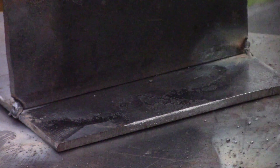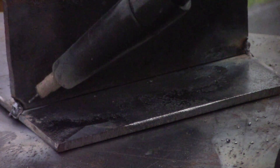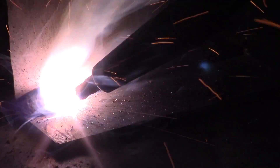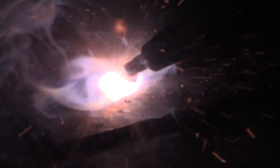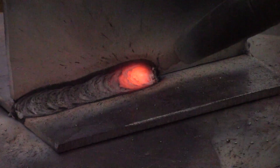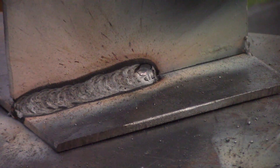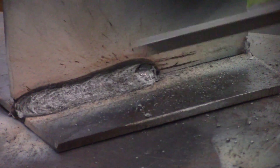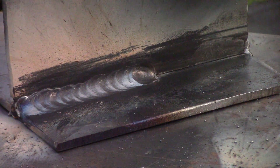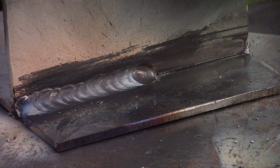Here's a closer view of what it looks like at the weld site — you can see the body position, the stick out, the wire manipulation. Right here I'm just doing a cursive E. Slow and steady, I'm watching the puddle, and I should have about half an inch of stick out — that means how far away the contact tip is from the metal. I'm a little short there, but it's still working for me. Around half an inch is the target. The machine is set at 8.5 on voltage and 8.5 on wire feed speed, and that's how it's coming out for eighth-inch steel.